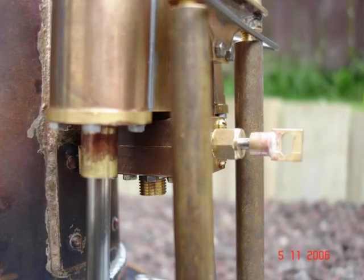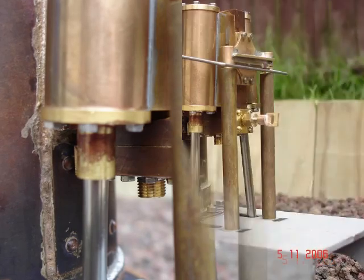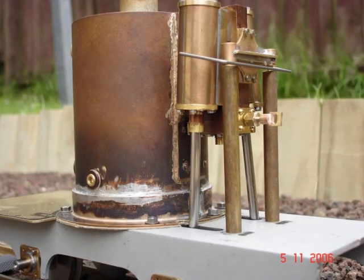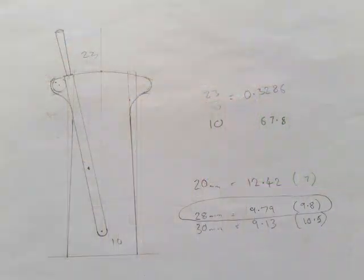Here's the valve in place. It's split down the middle so that I could deburr the cross drillings, as the valve bobbin has silicone O-rings at either end — we don't want them damaged by burrs. The body is gunmetal and the central exhaust is pointing downwards. You can see the two steam inlet holes at each end of the port block. The steam holes that feed the cylinders are blanked off at the top after drilling. Brackets have been brazed to the pillars, and valve control arms and shaft fitted.